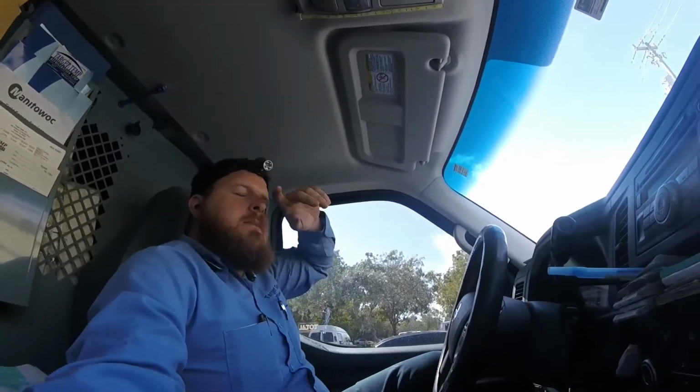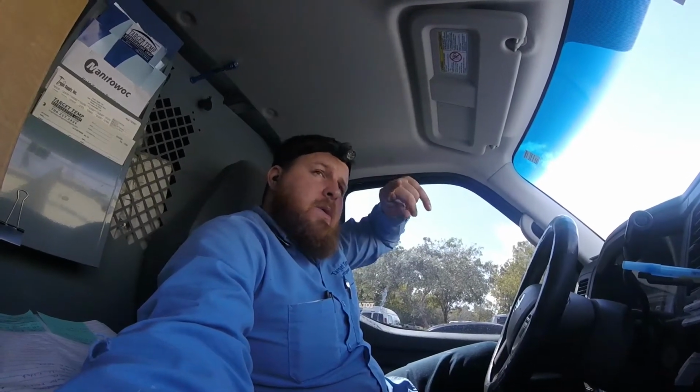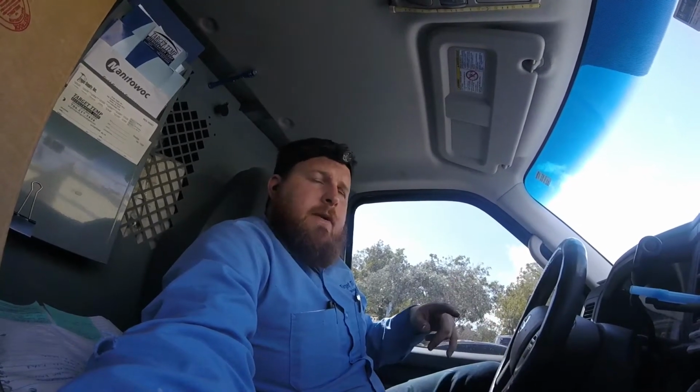So I was at this walk-in freezer on Sunday. Today's Thursday. And this restaurant has several issues. The thermostat was bad. It was stuck open, so the condenser wasn't coming on, obviously. I jumped it out. One of the evaporator fans, the bracket that holds the fan, one of the arms was broken. Also, the power wire for one of the fan motors rubbed on the sheet metal, and it arced, you know, and burnt off the wire, so I had to fix that.